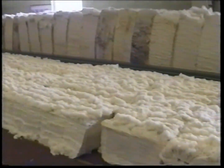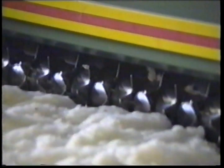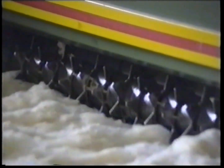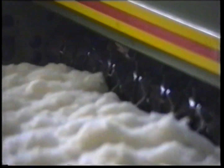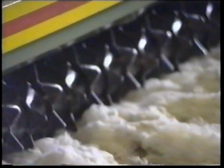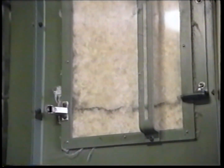The mattress of cotton is plucked by automated bale pluckers. Foreign elements such as metal are removed from the cotton. Thereafter, it is transported through a pneumatic piping device to systems that remove impurities like leftovers from the cotton plants, sand, and dust. During this process, the cotton is continuously mixed in special silos. The final result is a homogeneous mix that can be fed into the cards.